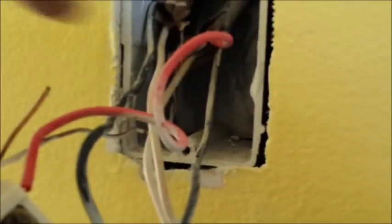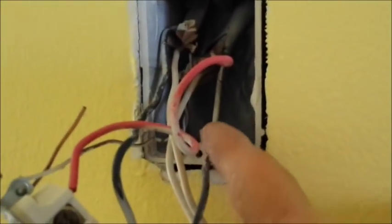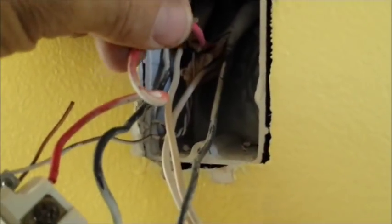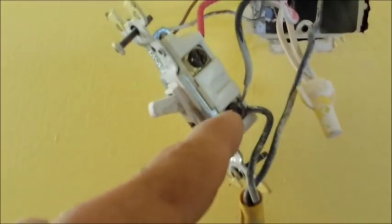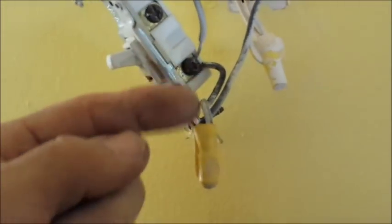The two-wire coming in is our hot source. You can see we've got the hot wire running to the switch, which gives the switch power. Then when the switch is on, it makes a connection point and it sends the electricity out to this red conductor on that three-way cable. On the three-way cable we've got a black wire — which kind of looks white there because of some extra excess paint, but that's really a black conductor. We've got a black wire that goes into that three-way cable as well. So that is a hot wire that comes off of this other hot wire. We can see these are all continuous.